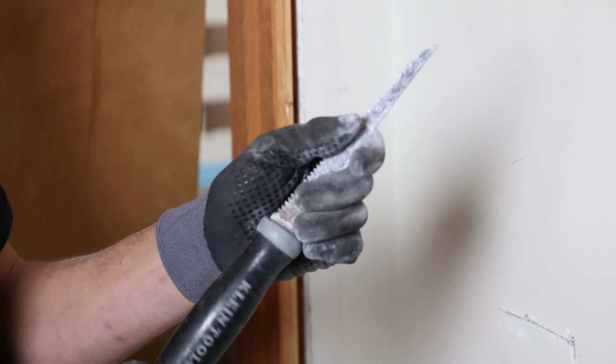We're going to go ahead and mount our box, put it up there with what she thinks she wants. We are going to account for drywall, that there's going to be 1/2 inch thickness drywall in this face, so our measurements consider that. To center on the vanity, we're going to be 15.5 off this wall to center of box, 9 off this wall to center of box. So we're going to locate that, mark it up, screw in our box.